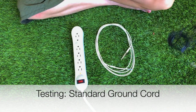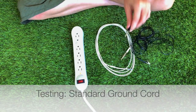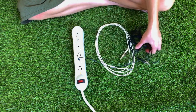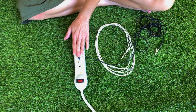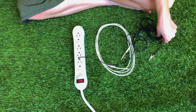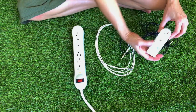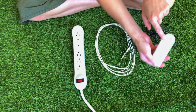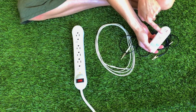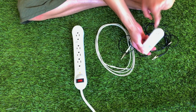We're going to just plug in a standard ground cord, which is what most people use — it's what all other companies sell with their grounding tools — and let's see what that does. We're going to plug it in only to the ground port on an outlet, and obviously if we put the meter around here it's going to read high because the strip itself is going to impact it. So we're going to follow the cord out to the clip and see if that changes the reading. Obviously if this isn't plugged in, the reading should be — hopefully you can see it — it's green, it's fine all the way out here. So if it's not fine when I have the cord plugged in, it's because it's traveling up the cord. So let's try it.